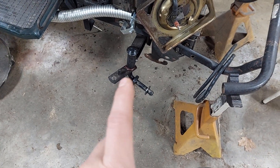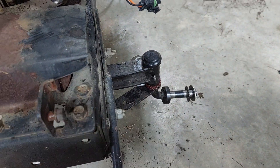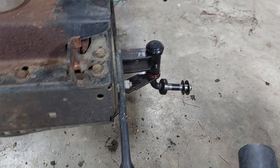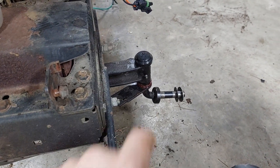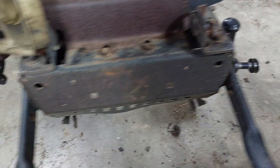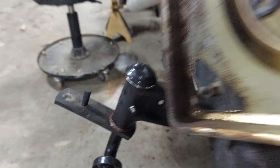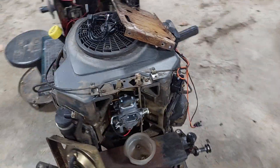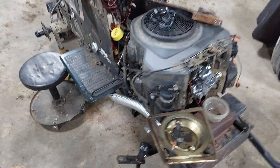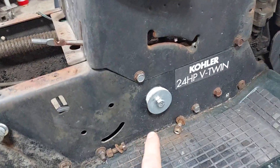The poor man's power steering is completely done. I do have to deal with these cheap Chinese replacement tie rod ends — I have a problem keeping them on, so I usually put stainless steel mechanic's wire around them. This one popped free and slid down; they usually hold themselves in place pretty well, but I probably just didn't get the wire tight enough. Also have a new PTO switch installed, and I've deleted the deck height handle and bracketry from underneath.